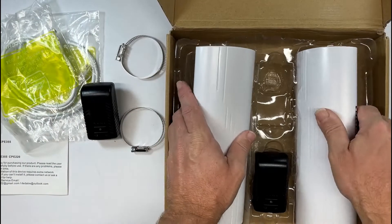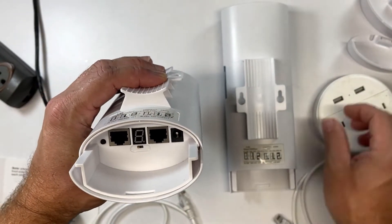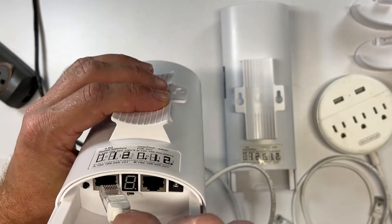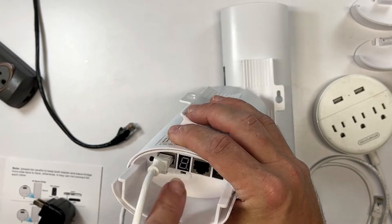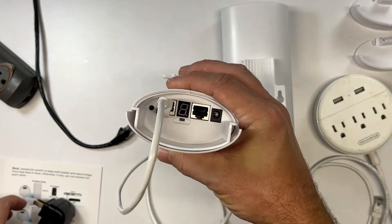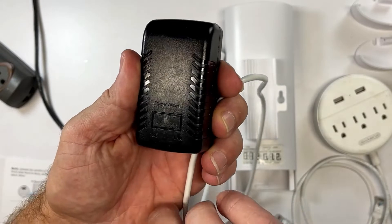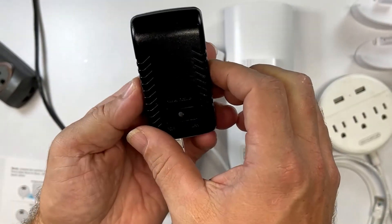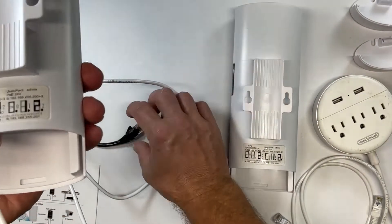Let's pair them up and see how easy it is. First, open the bottom of the device to access the inputs and the controls. Next, plug in the Cat5 cable in the LAN input. Turn on the A-B switch to A for the master. Take the other end of the plug and plug it into the PoE side of the AC adapter — this will power the system. Next, take your internet cable and plug that into the other port.